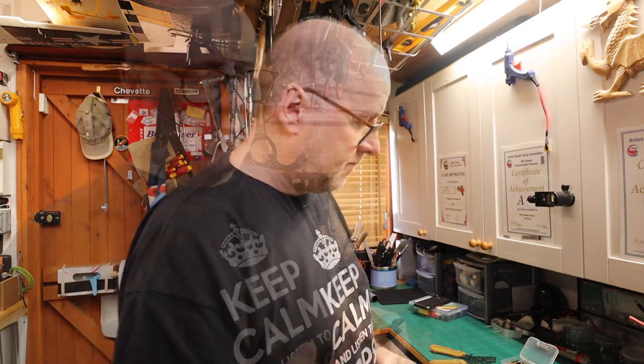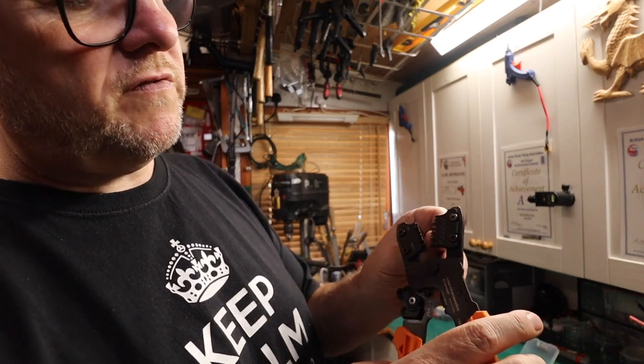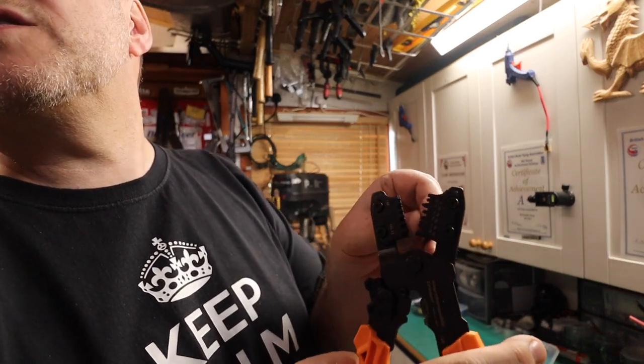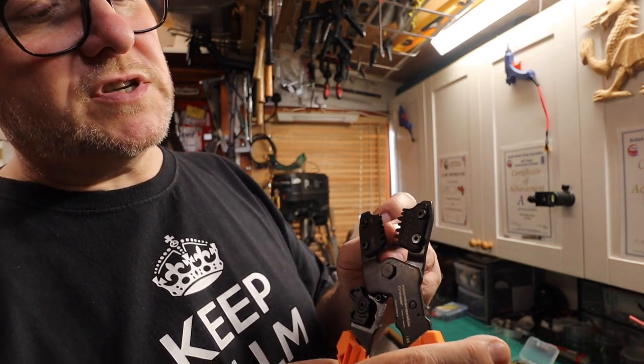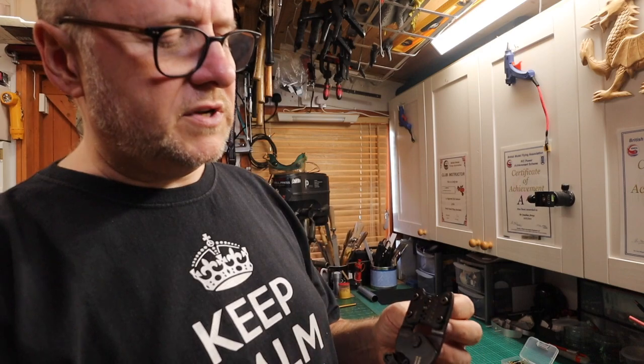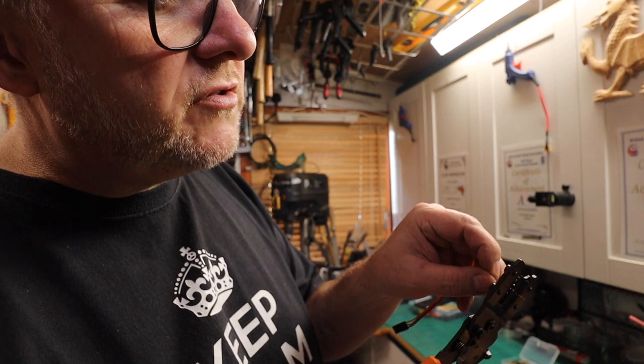So how to do that? These jaws have got different sizes to suit the different size crimps. You don't have to do anything complicated to measure it. What you can do is offer up the crimp until you find it fits into one quite snugly. Obviously you're looking at the recess, and you hold it lightly, and then you put the wire in and squeeze it. Better for me to show you. So like I said, you find out which one fits in best, hold it lightly, and then you introduce the wire into the crimp.